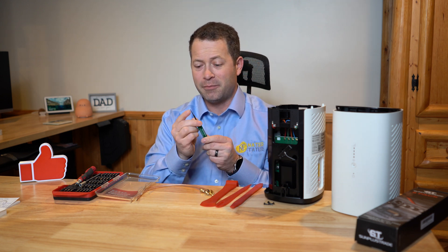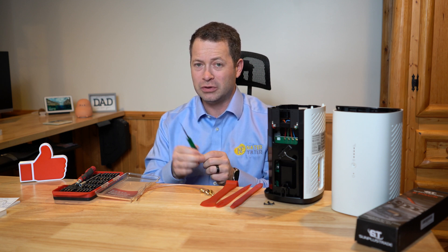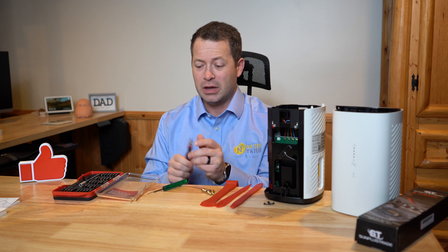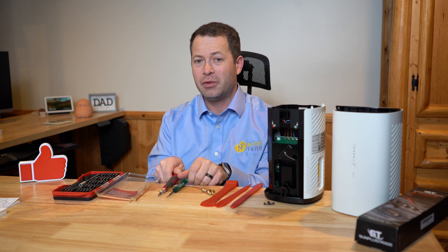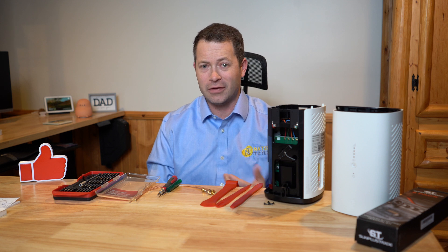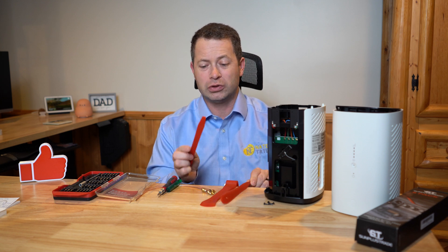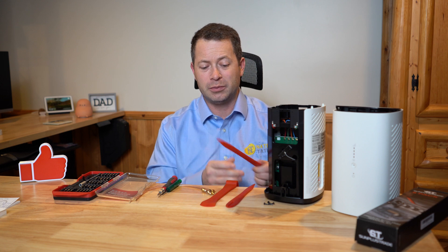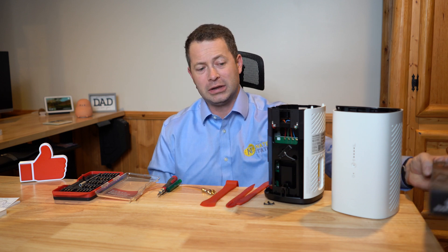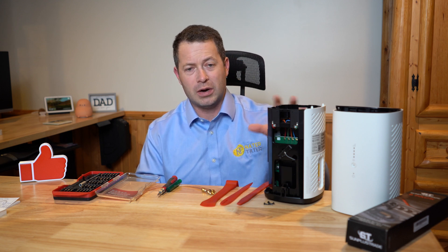As far as tools you're going to need, the bare minimum is some kind of pick or pry — a fairly skinny one, like a super small flathead screwdriver or an electrical pick. You're also going to need a T10 Torx bit. Beyond that you'll need something for prying; a flathead screwdriver will work but will mar up the plastic. If you want to be more careful, get yourself a plastic trim tool kit, the type typically sold for automotive trim prying.